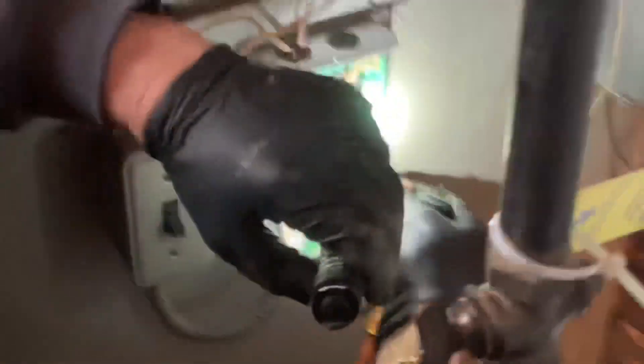One wire is going on six, normally open. The other wire is going on common, which is number five. They're secure there. Let's tuck this wire out of the way.